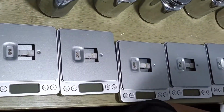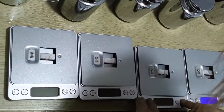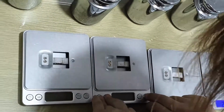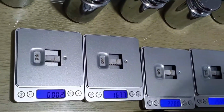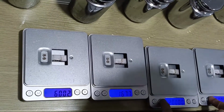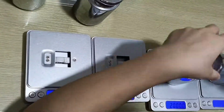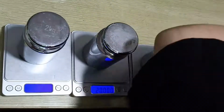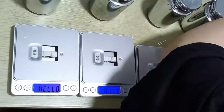Sixteen, calibration, including power on to check if 7 units are available. Select the maximum range. Put the weight to calibrate. It means OK when pass appears. Turn off, then power on again to test overload by pressing on the weight.